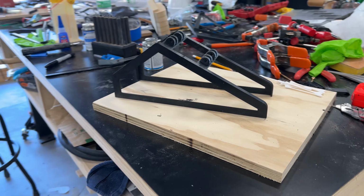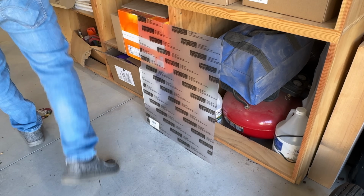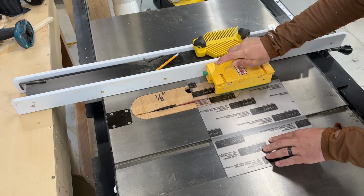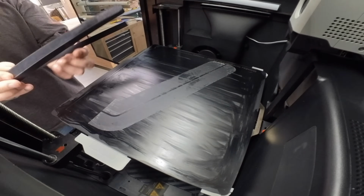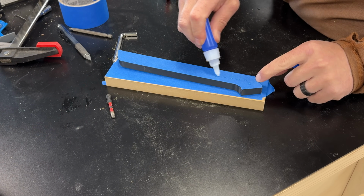To get this hood enclosed but maintain adequate visibility, I used Lexan or polycarbonate. I believe Lexan is just a brand name. The upper face/nose required a very specific bent radius. To accurately achieve this, I printed a template I could then transfer to several pieces of 3/4 inch MDF to create the bending form.